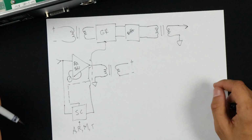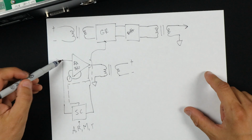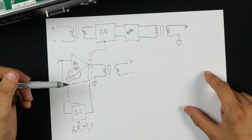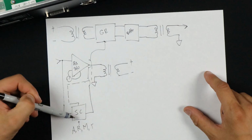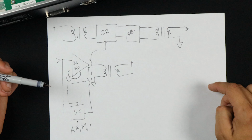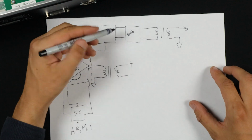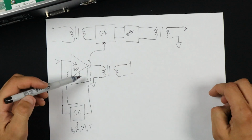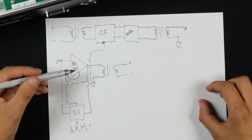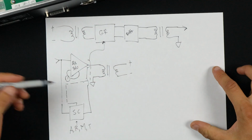And note that like most compressors we've dealt with in this series, this is feedback because we take the sidechain after the gain reduction. So the gain reduction is seeing its own work reflected back in its control signal. It's a little bit of a mind bender, but that's how we account for some of the nonlinearities and weirdness of compression like this, by feeding it back into itself. So it's a feedback style compressor, and it's a diode bridge compressor, as I mentioned at the top of the video. And what is that?